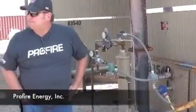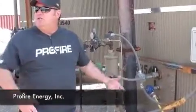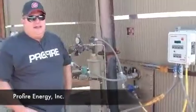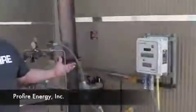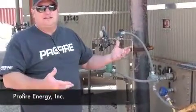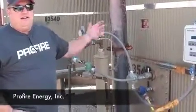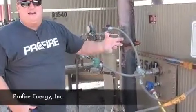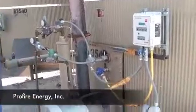It requires the person to be here to do it, too. If this is where there's an office, so it's close, but if you're out at a wellhead out in the boonies, then you may not know that it's out for two or three days. And it will just be out spewing gas for two days until somebody goes out to check it and make sure it's lit. Where if this system's there, it will detect the fact that the flame's gone and light itself within less than a minute after it detects no flame — so that's the advantage.